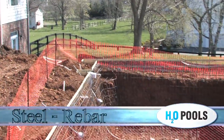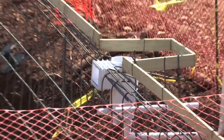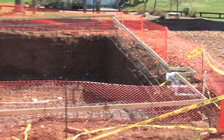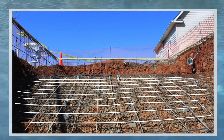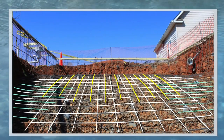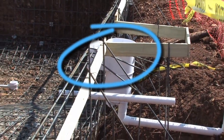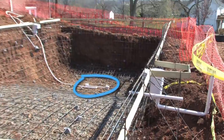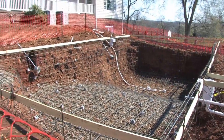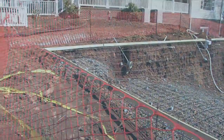The next major stage of construction is the installation of the steel reinforcing, or rebar. The lattice of steel is carefully planned with differing dimensions depending on the area of the pool and the strength required. At this stage we also begin to see the initial placement of the skimmer, the pool drains, and even the lighting fixtures. The excavated portions of the site are surrounded by a fence for safety.